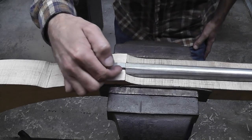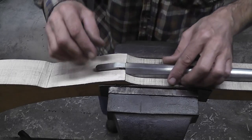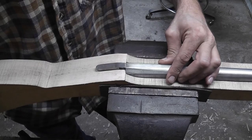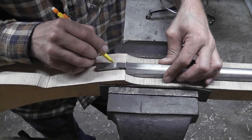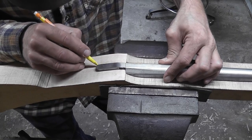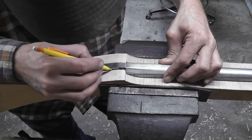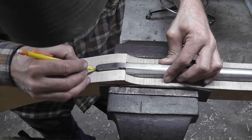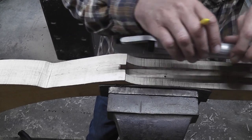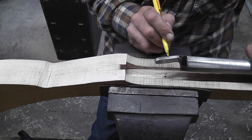Down in here I've got about an eighth of an inch to go until I reach the bottom of the barrel channel, so I'm going to remove all that wood down to the bottom of the barrel, stabbing straight down and coming back. I've got this wood removed all the way down to the bottom of the barrel channel and the barrel falls right down in there. It's time now to bend this tang down — I wait to do it now because I've got the same thickness of room to inlet here as the thickness of the tang back here, so I can eyeball it better. I'll take my wood mallet and vise and give it a good whack. I put the barrel back in and look at it — I need one more, maybe one and a half bends. Now you can see our bend is a lot closer to the barrel back here. If I would have left all that radius, the bend would be way up here. Now I'm going to trace around this tang.